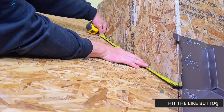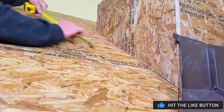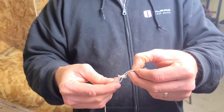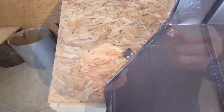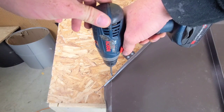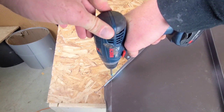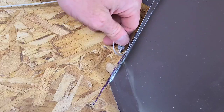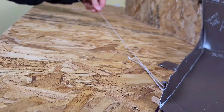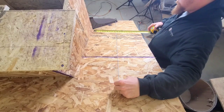Let's start by getting sidewall length. These measurements are going to come into play later on. I'm going to tie a little knot in a little string. We're going to install a screw in line with the seam of the panel. This is going to allow us to hook the string on, extend up, and here I'm going to get my parallel line.